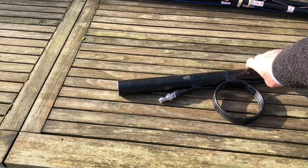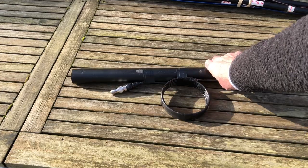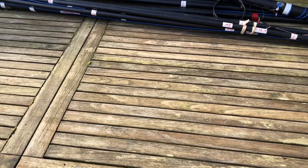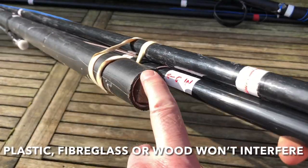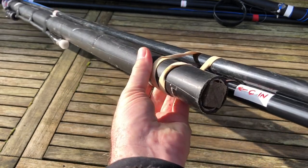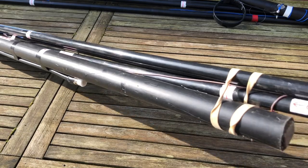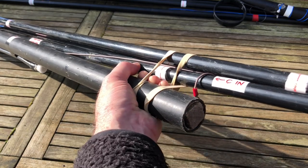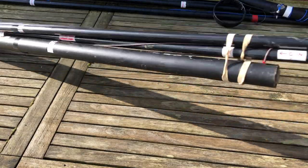And speaking of the stub mast, it's still hollow at the moment, so I can put it onto the test tripod. But what I've done on other antennas, and this, if I move up a bit, this is my 6 meter mini horse. I've used wood through the stub mast, so that makes that strong enough, that clamps on to the top of the main mast, and that wood just adds that bit of strength when you're clamping. So there's various ways of attaching. You could just go straight up with a pole and add some sort of clamp, but I use wood, and then I clamp on the outside to another pole. So there's lots of different ways of using this plastic, and that's the 6 meter mini horse all wrapped up, ready to go.